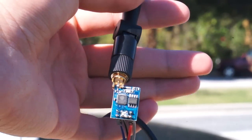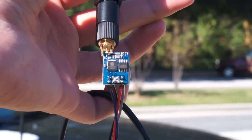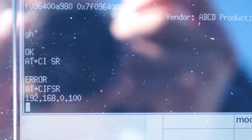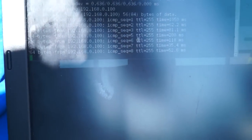First, I'm going to test this little Wi-Fi module that I hacked a huge antenna onto. I don't know if that's actually going to work — the spec sheet said you needed to do something different for that. But we'll just see how far this thing works. I joined the TP-Link and it got an IP address from it, 192.168.0.100. And Mark right here is trying to ping it right now. You can see the pings coming through — just dandy. Let's go take this thing on the road and see how far it works.